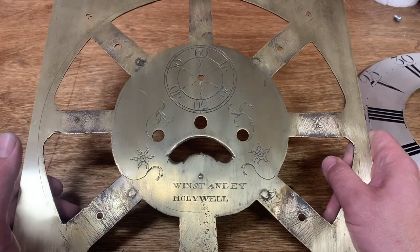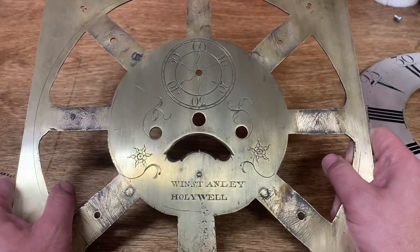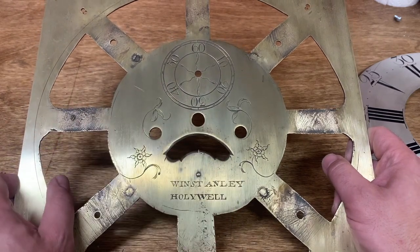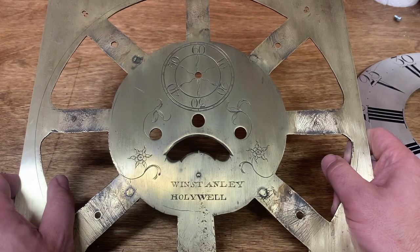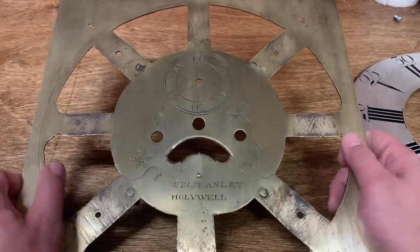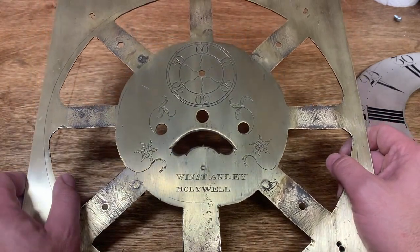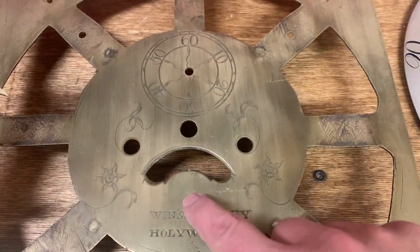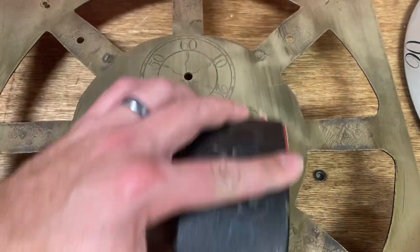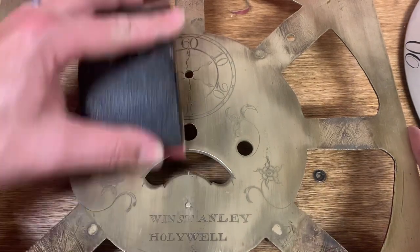So we've got some of the prep in, and what's left really is the differentiation between the process I showed in my prior videos and the steps of the Clockmakers Guild. I'm going to start with some 400 grit — actually more like 320 grit — sandpaper, and I'm going to try to work in as straight a line as I can to remove the rest of the tarnish. Brass that is engraved like this is pretty resilient. You can actually sand on it fairly aggressively without wearing into the engraving that much. A sanding block helps me keep it flat. Taking longer strokes helps get rid of the start-and-stop marks.